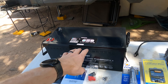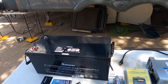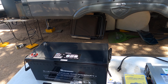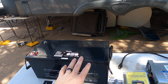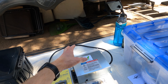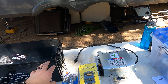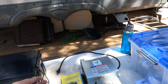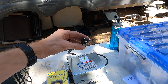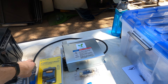As I get this battery installed, there are a couple of things to remember with lithium batteries. They have a different charge profile than the standard lead acid batteries that might be in your RV. So if you're upgrading from a lead acid — whether it's AGM, flooded, or even a gel cell — and you're moving to lithium, they have that different charge profile. There's a very good chance you may need to get a new charger. We decided to bump down the amperage to 60 amps from 65, so that if we end up at a site without good 30 or 50 amp power, we can still plug in directly to the pedestal using an extension cord and still get those batteries charged.